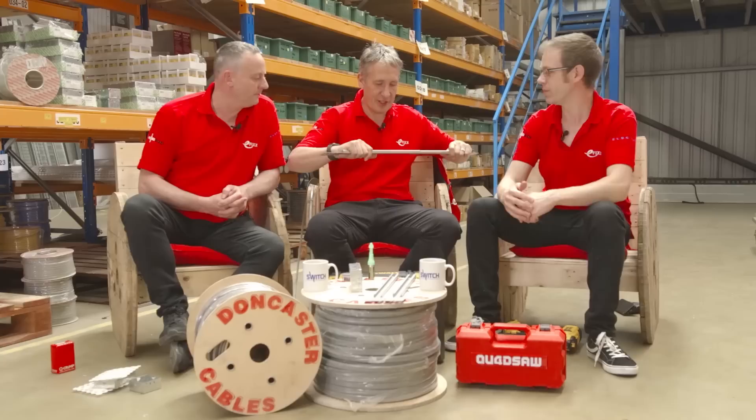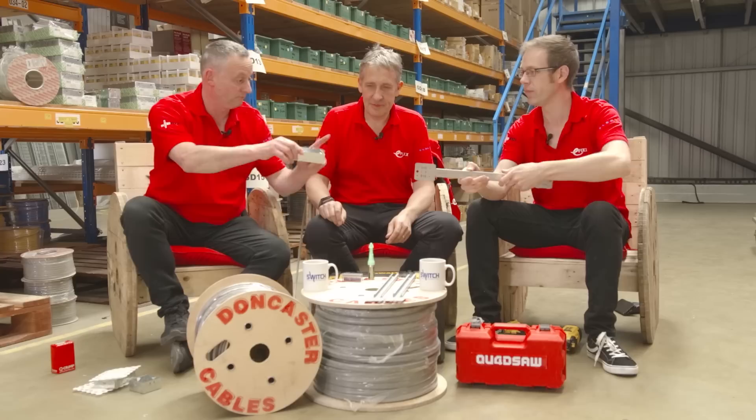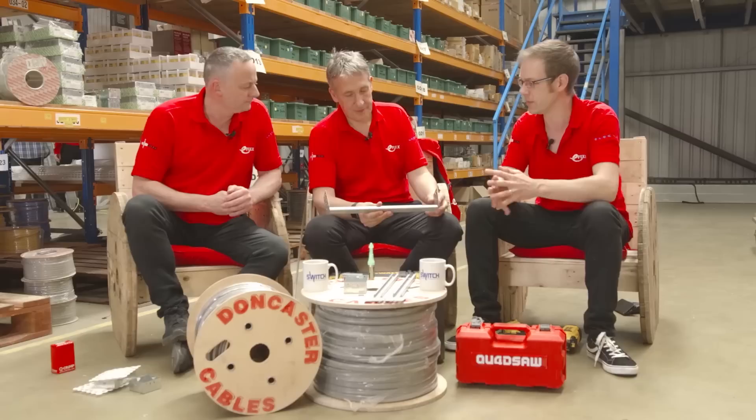It comes like this and you break those two bits apart, then they slot together. You can position that between timber or metal studs. Then fold those wings back — they fold back and allow you a fixing, and then you can screw your box on. You can place your box on like so, and because it slides it can go between any spacing.